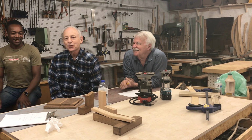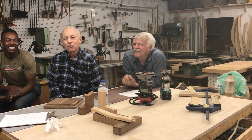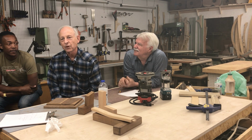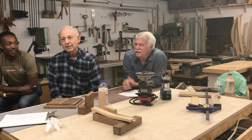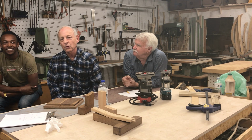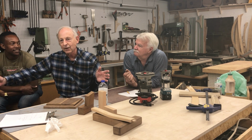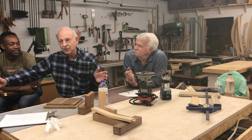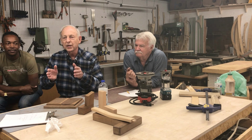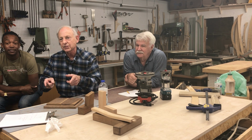I disagree 100%. Okay? If somebody said, I'm gonna take your table saw from your shop, I'd shoot him right between the eyes, okay? I've got a Delta Unisaw that's 25 years old and the total runout on the blade is 2/1000ths of an inch. I've got a digital readout that goes out to 1/1000th of an inch. I can cut dado joints, I don't care what you tell me to cut, 0.926, and I'll give you a dado joint that's exactly 926.